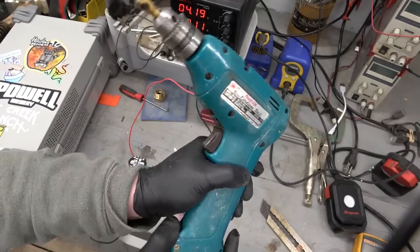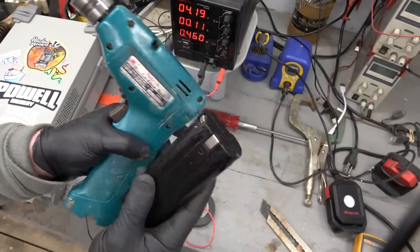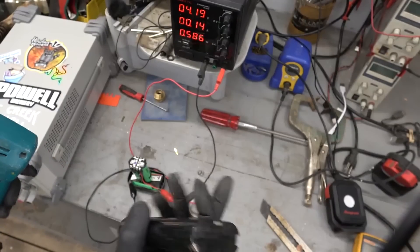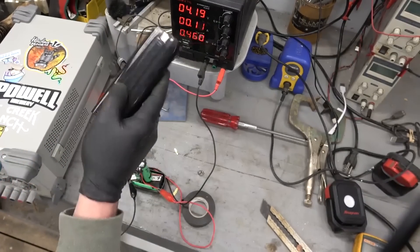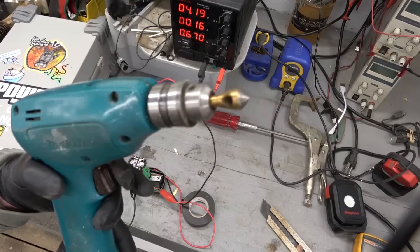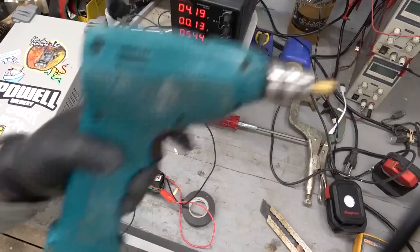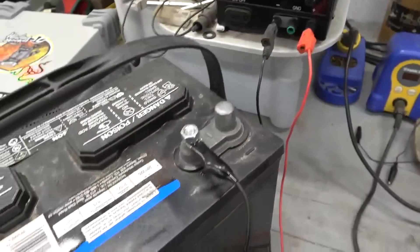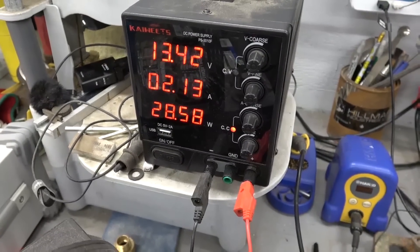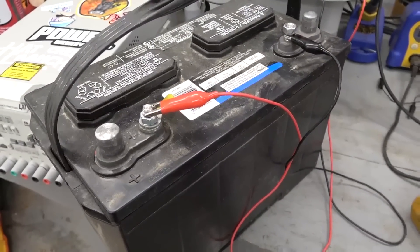Same with this old battle axe. You can buy these for pennies because nobody likes the batteries — these NiCAD batteries. The chemistry is quite a bit more robust and less finicky than lithium, so you can charge these up with your power supply. Now you've got yourself a deburring drill for your CNC machine. Regular old car batteries occasionally go below the voltage that electronic chargers will allow, so it won't charge. You just bring yourself over here, force some current in there, and then it'll go. So sometimes you can salvage a battery — sometimes.